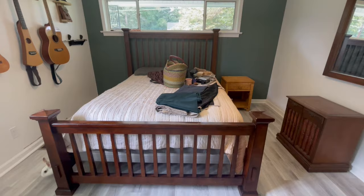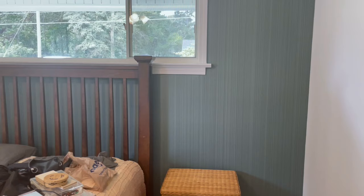That's what the wallpapered wall looks like. It came out really nice — there are parts where I couldn't even find the seams, so the painting behind it worked really well. I lucked out that there's kind of a pattern to match. There's definitely a top and bottom — one end of the sheet has a thick line and the other had a thin one, so I could figure out orientation. I did some touch-ups, mixed a color, and fixed the top line because it was a little uneven, and around the windows too.